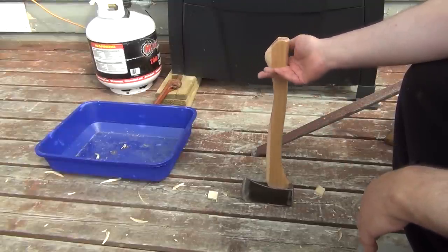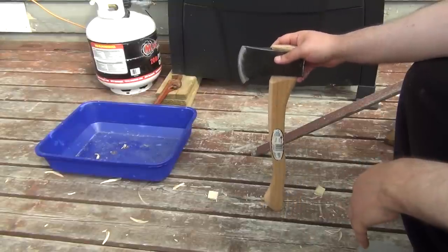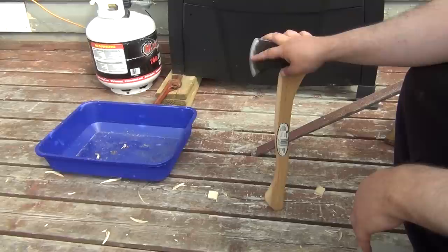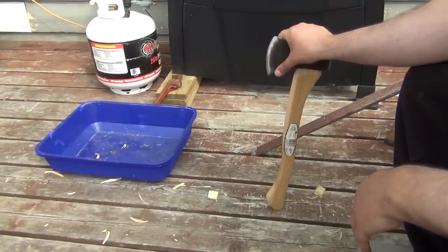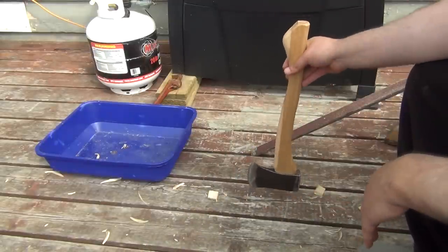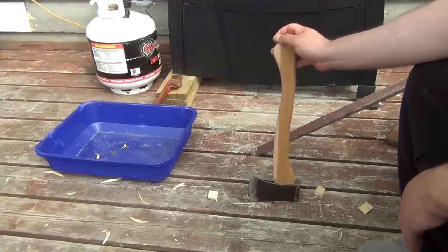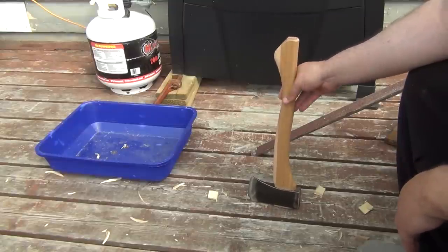Not something that you take for felling, but for deadfall cutting — very nice. I did clean up the bit on this significantly. This had a much more pronounced asymmetry in the sweep. I took a lot of metal off to reduce the asymmetry and get the curve to blend back in. More metal should actually come off to make it perfectly symmetric, but these are going to be used very harshly as utility axes. Whenever friends or family find out you do this, you tend to get them on request quickly. Next time it's dropped off, I think I'll clean up the bit a bit more.